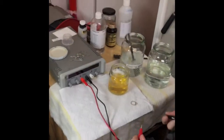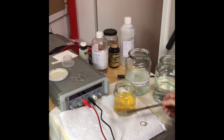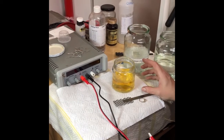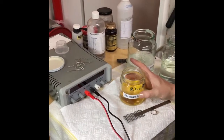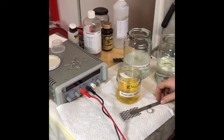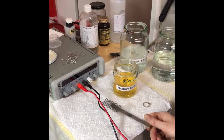Today we're doing some rhodium plating. First, what you need is a titanium anode. This is specifically with bath solution — this is already pre-mixed. I'm not using the whole gram at one time, only using a little bit, so that if you contaminate it you can throw this away versus using your whole one gram at a time, which is an expensive mistake.